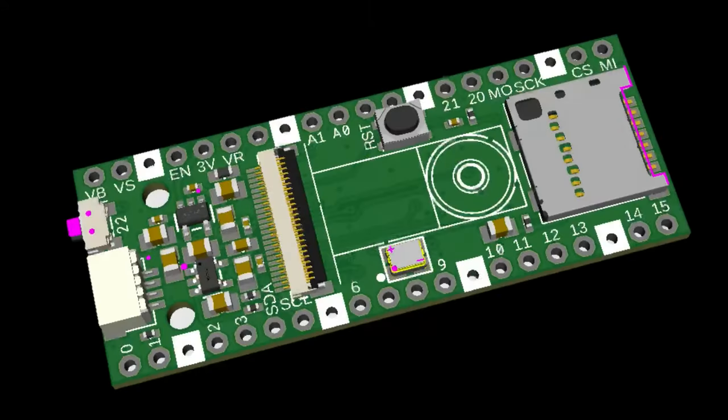This is a Camera Pico Bell — we do have camera support for the RP2040 for using the OV5640, OV2640, or similar. The problem is the wiring is a total nightmare, so this does all the wiring for you. It uses a lot of pins but you get full-color camera with JPEG or RGB output. There's a little micro SD slot so you can save your images, a little button for a shutter, and all the power supply stuff you need.